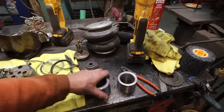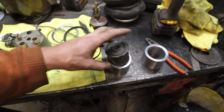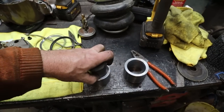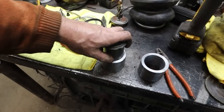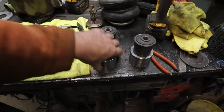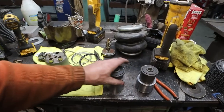Well, because I am no machinist, that took me a really long time. But that's okay. So we're done. These are super tight, but that's the idea. They're supposed to be a press fit. I think there's a thou difference. So we should be good. We'll see. Hopefully I didn't screw up. That's got to be pretty good. I think that one's good. It'll work. It'll be fine. Yeah, she'll be good. That or a bigger press, I'll be able to squish them in there.